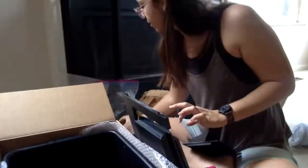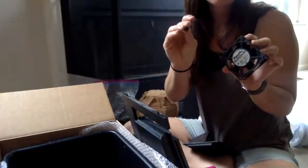Yeah. What I couldn't find was this adapter. Oh, it's on there already. Oh, okay. So that little piece at the end comes off, and it's plugged into those 2 wires. It's basically just to adapt it. I mean, you could hardwire it, but that's just easier. That plugs right into your adapter. And then that plugs into the wall. But in your case, if you're in an RV, I don't know if you're going to have outlets. If you want to hardwire it DC, then you don't need the adapter at all. You just hardwire it into your system with a switch. Or generally, it'll just run continuously. But it'd be good to have a switch on it in case you ever want to change it out or do something.